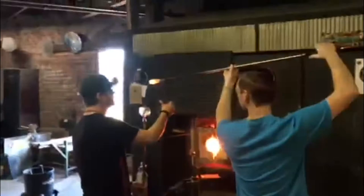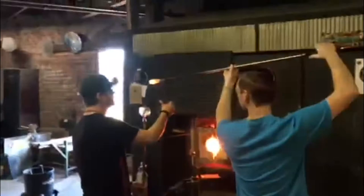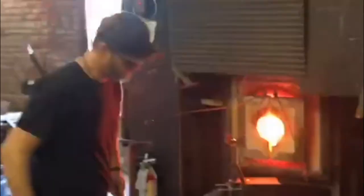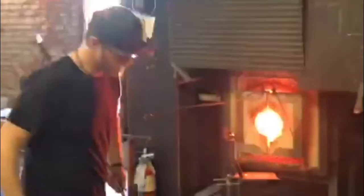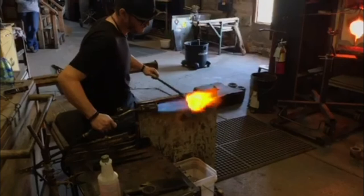Daniel then causes the glass stem to drape onto the top of the pumpkin. Here, you can begin to see that the pumpkin is going to be clear. Jeff uses shears to pinch off some of the stem glass and to shape it. He uses a torch to help soften any sharp places that may remain on the stem, which helps reduce cold working time later. Using tweezers and rotation of the punty, he creates a fun, curly stem on the pumpkin.